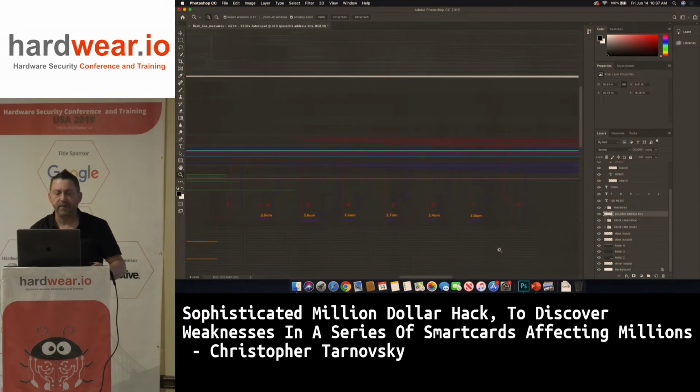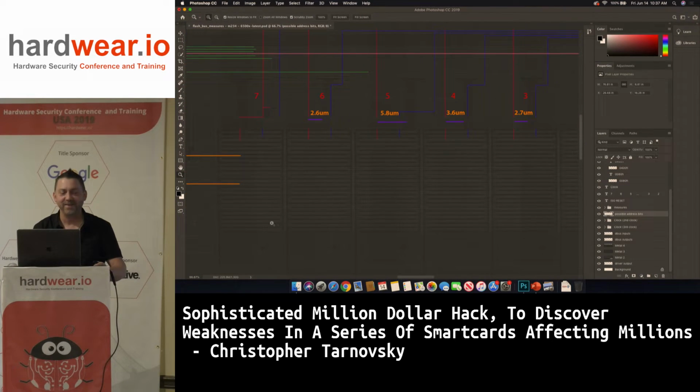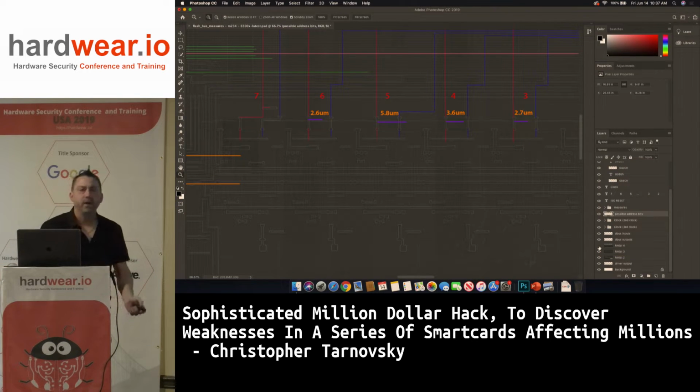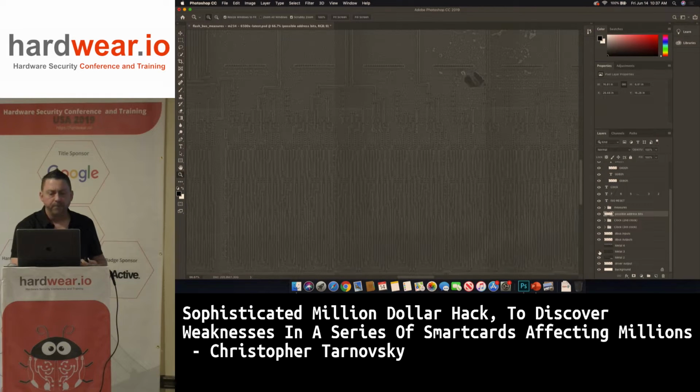Yeah, so you can see this was the flash outputs. It was pretty easy to see, and it gets even better. This picture gets funnier. This is how easy these guys are. They're trivial. I would say they're trivial at most. I don't know if everybody can see, but this is another layer imaged in the FIB. It wasn't polished. When you get down to 140 nanometer, you're going to have problems polishing with wet chemicals. You're going to have to use RIE etch and a combination of RIE etch and mechanical polishing. So this is crap for images. This is not good.